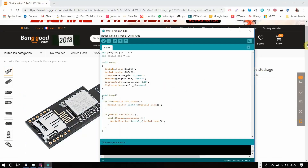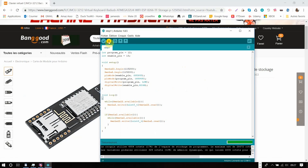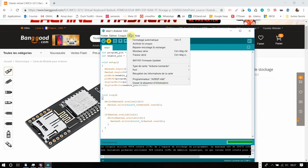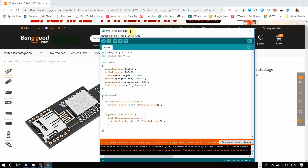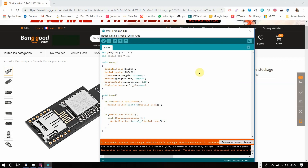For people who know Arduino, this is a Leonardo board. The first thing you do is plug it in. I've already prepared an initial package to upload to the board before flashing the bootloader. Make sure you select Arduino Leonardo and the port matching the board on your computer. Then we start — this is the important part.